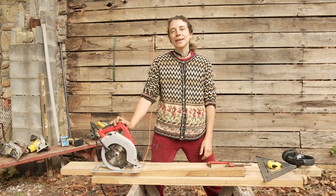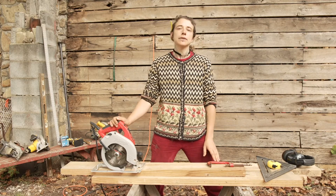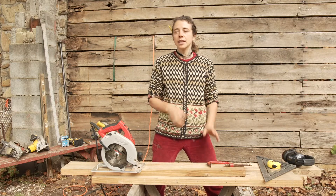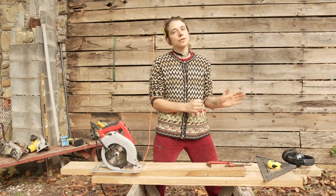In this section of the video we're going to be looking at the common cuts that you make with the saw. We're going to be doing a cross cut — just straight across the material — we're going to be doing a rip cut in line with the fibers of the material, and I'm going to show you how to do a plunge cut if you have to start somewhere in the middle of your material and you can't bring the tool in from the edge.